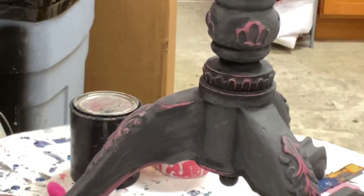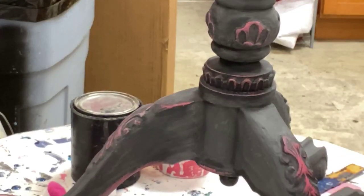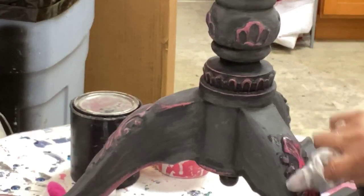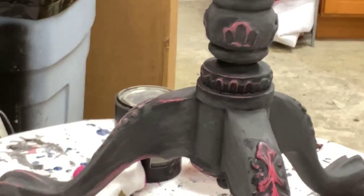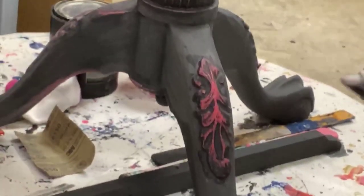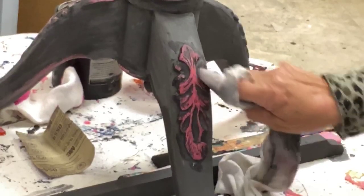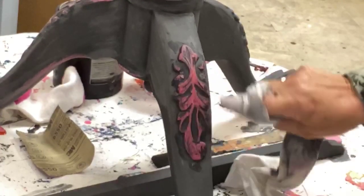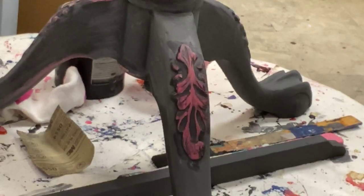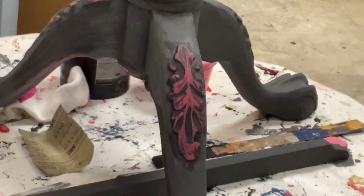All the colors tend — like the pink — to look dirty as soon as this dries down again. But when I come back at it and wipe down a little more and wet it, you can see how the colors pop up nicely. Desiree, it's just water. Old World Finishing paint distresses simply with water. So we are just rubbing it back. That's why you have to top coat it though. It needs to be waxed or glazed or top coated or all three in appropriate layers. Otherwise, you don't have any durability out of this paint.